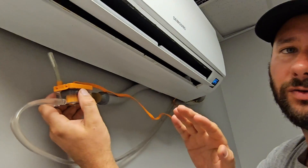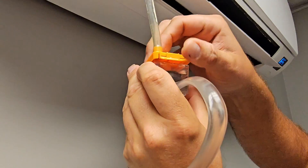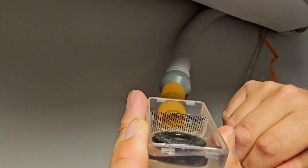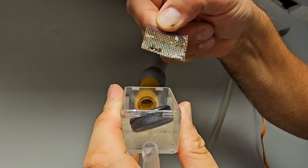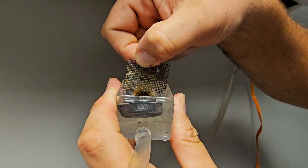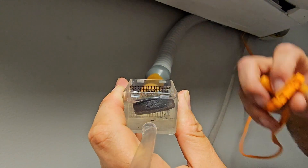I'm going to show you what needs to be maintenanced. Take a look — top of the reservoir, take it off, and there's a filter. At least every six months you need to be taking that filter out, cleaning it, and putting it back inside the reservoir.